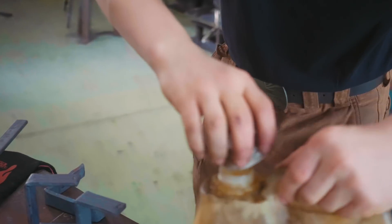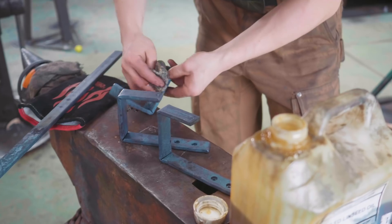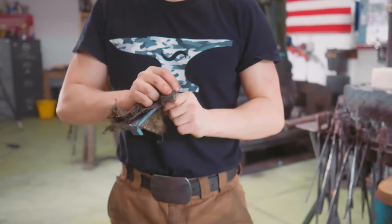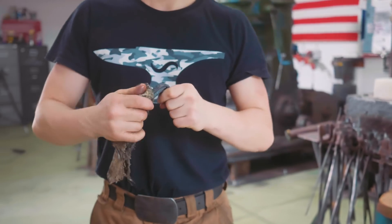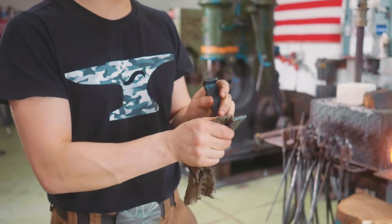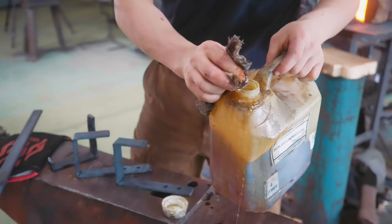We'll do a little bit of a linseed oil finish. However, the pieces are cold. As I said yesterday, it's going to be interesting to see how the difference between the cold finish and the hot finish holds up. In this environment it's pretty dry — it's not actually a very damp workshop, thankfully, unlike the old workshop, which was a damp workshop. I don't think there's going to be any noticeable or appreciable difference, but of course it's just a slightly thinner coating and it tends not to be quite as durable.